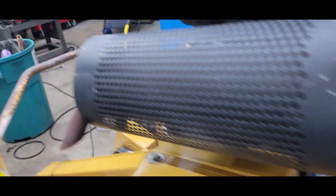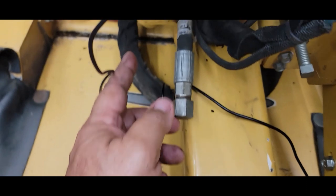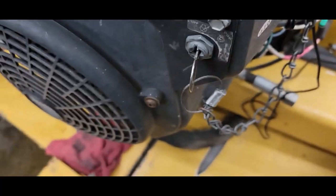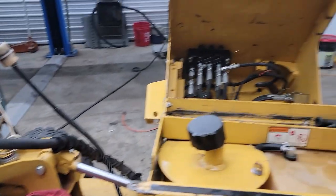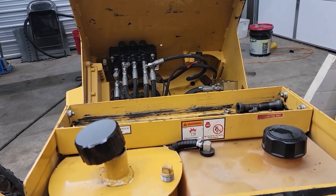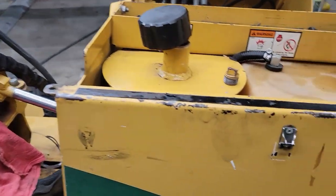I know some of you guys are scratching your head and saying, well, who would know? There's the drain right there on the bottom on a ZT, and I don't know on the SGs, but on the ZT and SG40s, they'll drain in the same area, the bottom. You'll look at it and say, it's the bottom of the block down there, it won't have a plug. It'll look like a socket hole, but you can put a 3/8 extension right in it and spin it out. That's the little new mod they put on stuff.